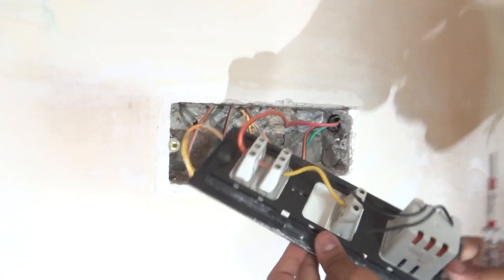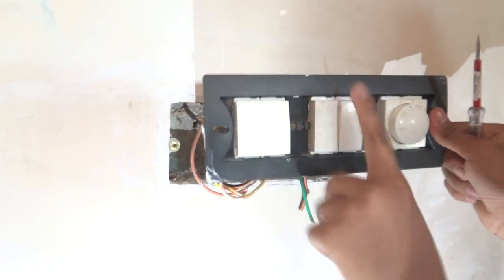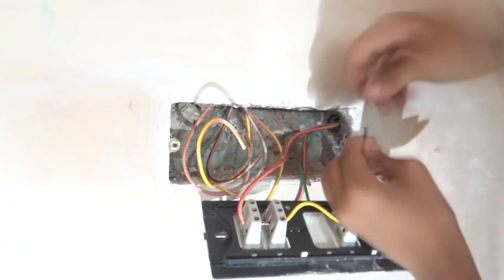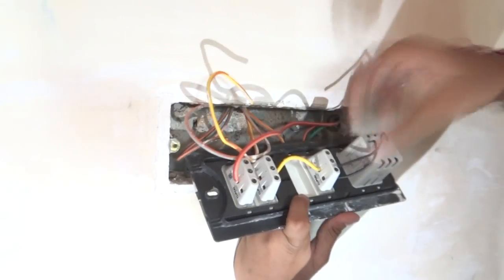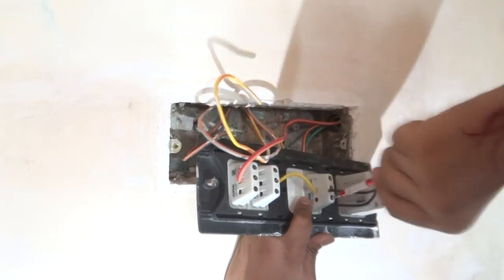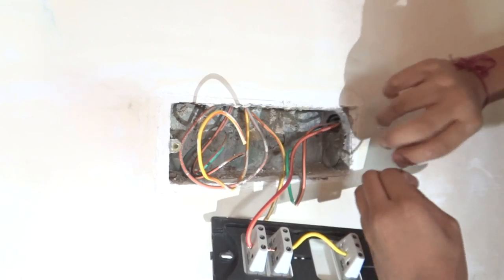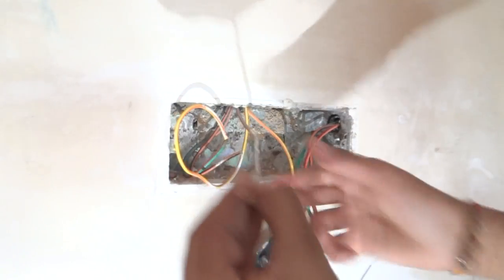As you can see, the phase wire connection is completed. Now we are going to be connecting the fan regulator in series with the switch, so that when the switch is turned on the fan regulator can be adjusted and the fan will turn accordingly. Remember that the fan regulator is not polarized, so you can connect any one wire to the switch and the other to the fan point. Now we are going to skin the other side and tape it with the grey wire which is our fan point wire.